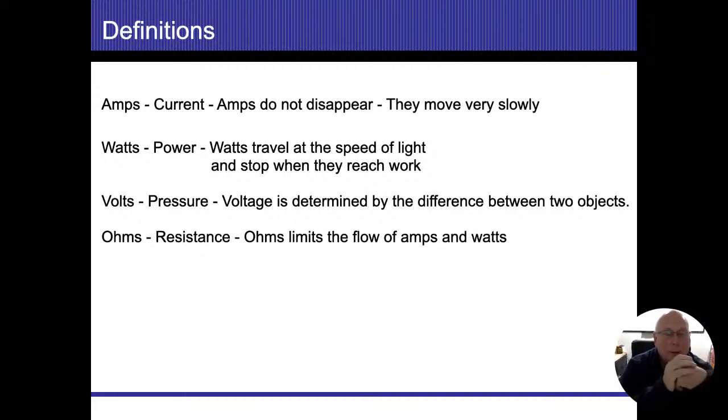And going back to our grounding example before, I think I said 5 amps. It's partly because the earth is a gigantic resistor, for lack of a better term. When electricity flows into the earth, it's really trying to get to the transformers on the pole. But the earth creates a resistance, ohms, and it's limiting the amount of flow going through it. So as long as it keeps limiting that flow, we're not going to exceed the breaker usage. We're still going to stick in that 5, 6 ohm range, somewhere in that ballpark. All right.